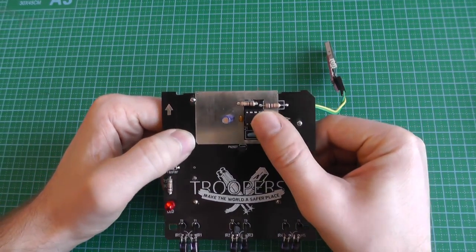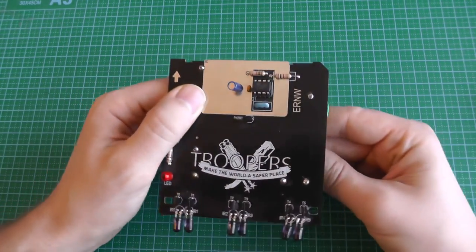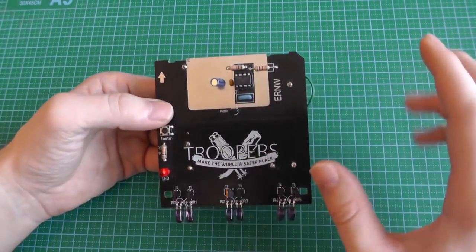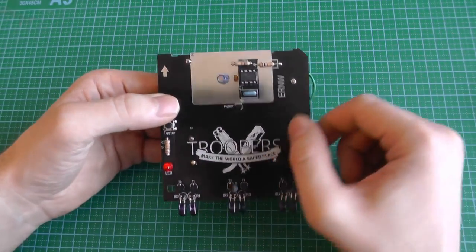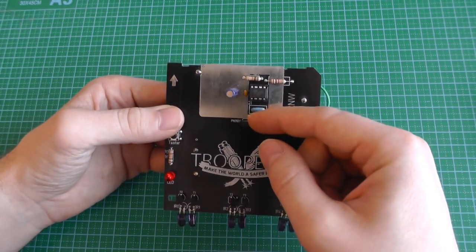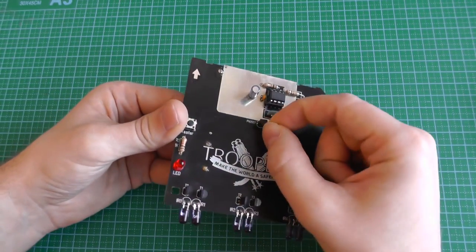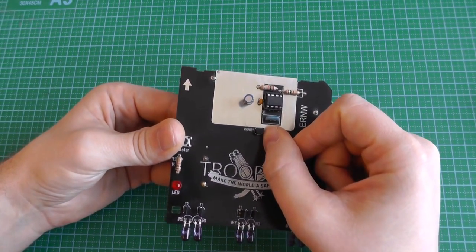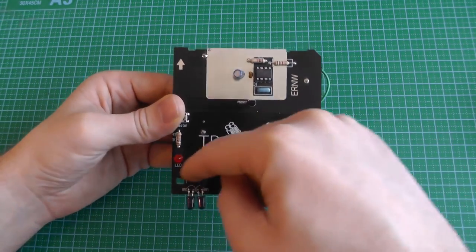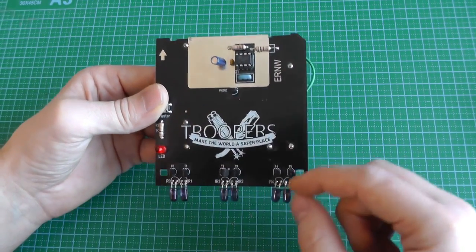These Atmel microcontrollers, and almost all microcontrollers, support generating a PWM signal. It's one of the timer options. So you simply program the timer in a PWM mode, you set the frequency at which it operates, and then you say just one pin toggles every time to generate this signal. So this is the first transistor, which then controls all these 6 transistors. And these 6 transistors will control if power goes through the LEDs or not.